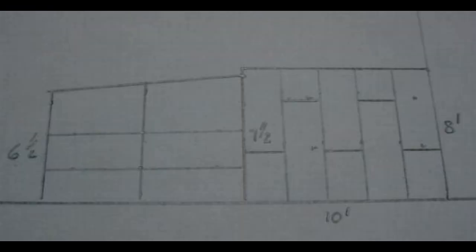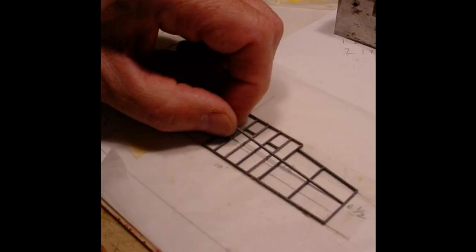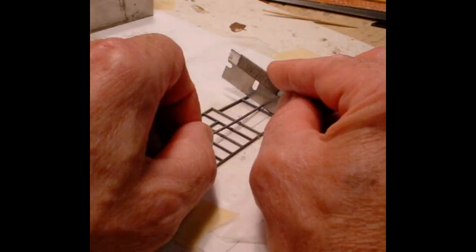So as always, I started by drawing the diagrams for the sides of the new sheds. And then they were to size, so I was able to start framing right over those diagrams. In these next few shots, you can see me framing the structure out, building right on top of the diagrams. You can see that I often cut the pieces for the framing right in place on top of my work. And then once the framing was done, I could start adding the siding.